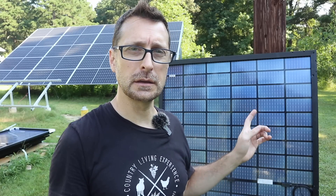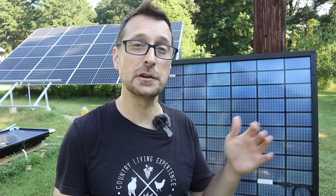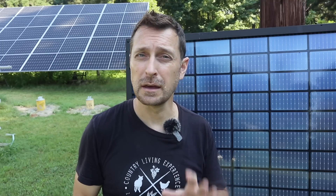These panels are 415 watt bifacial. The back is rated for about 300 watts but you're probably going to get about an extra 120 watts realistically. The voltage open circuit on the front face is 37.42 volts. When doing your calculations and adding your panels in series, you need to accommodate for that bifacial gain, especially in winter when colder temperatures cause your voltage to spike. Take a look at the max voltage your inverter can handle and calculate accordingly. These can produce about 539 watts with that bifacial gain added in, so be careful - you don't want to fry an inverter.